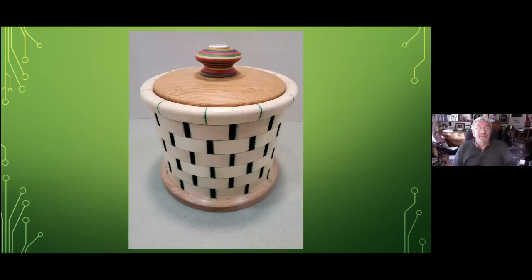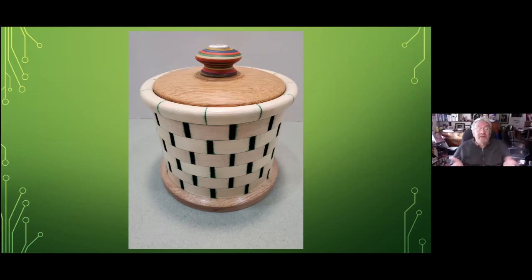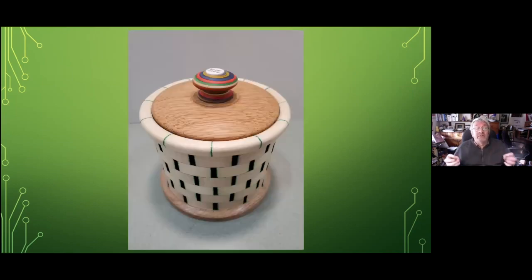It's an open segment box. The green is food coloring. And when I had turned it and sanded it down and applied the first coat of water-based Varathane, it pulled a Rudy Giuliani on me and ran. So I ended up applying 4 coats of the Varathane using a pipe cleaner folded in half. It gets in there very nicely. And you can see in the end grain, it gets sucked up by the cells that transport. And on the side grain, it makes a nice straight, clean line, which is neat.